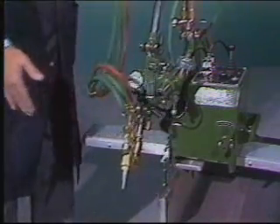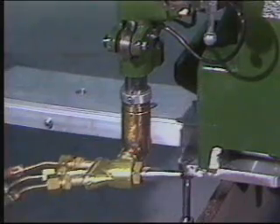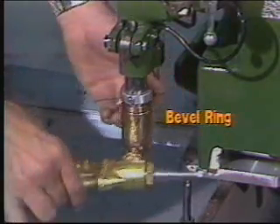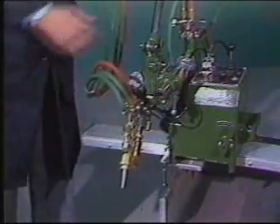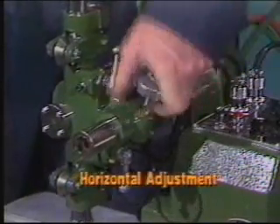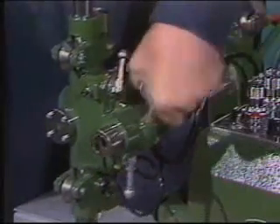The Mini Mantis can also be used for straight-line cutting of flat plate. A graduated torch bevel ring allows you to bevel the flange in either direction. To bevel the web, you adjust the vertical torch bar. The Mini Mantis has a 4-inch thick web capacity. You also have 6 inches of horizontal torch racking motion, and a longer torch bar with 12 inches of travel is also available.